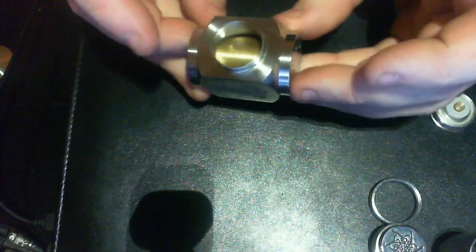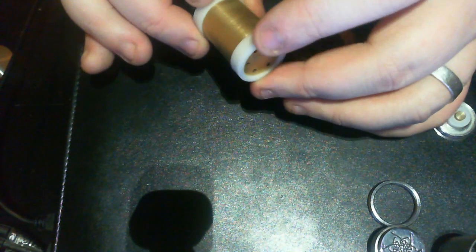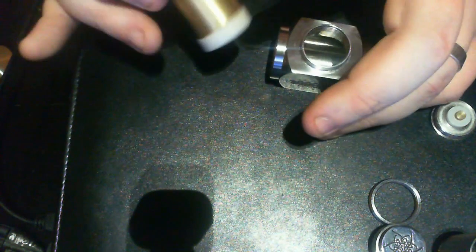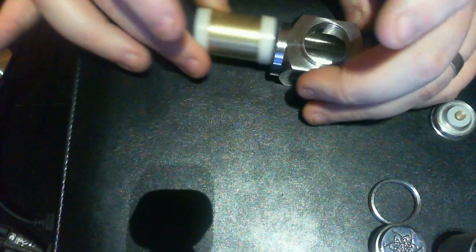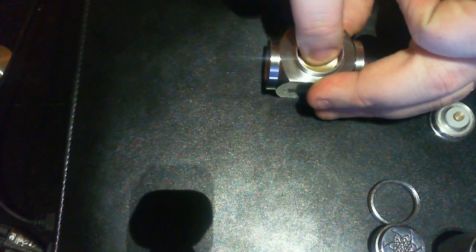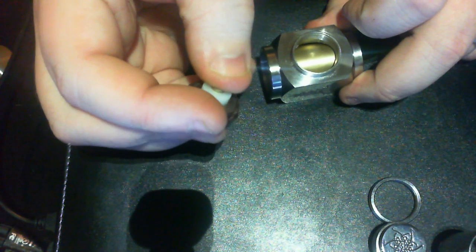Right. So back to our hammer. Here's what we have left. Inside the hammer, right here, is a copper tube. No, a brass tube. And your brass tube has these plastics around it, and that is to stop it shorting on the hammer itself. This brass tube is your positive. This is a big, big, fat positive connection. So as you slide this in, you can see we've got a brass tube sticking out. That is where the small spring-loaded contact gets.